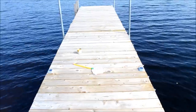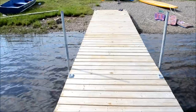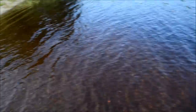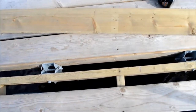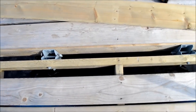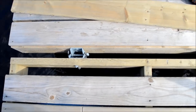There's this one here, and of course you'd have another one at that section right where you see the poles. I'm not going to pop all the boards up, but you can get an idea of how this works in the other two spots. That's it — you float these sections out. You could do it by yourself, but two people are plenty, because once you get it to the water it's just floating. You float it out, walk one end into the other, slide the bolt through, pop the cotter pin down, and you're off to the races.